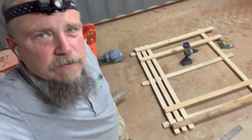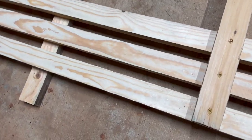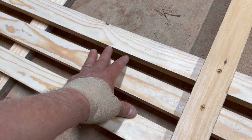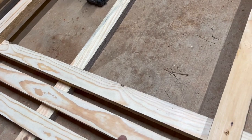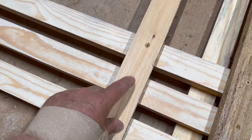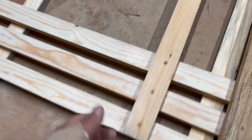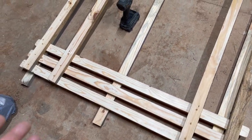Working in the evening, I'm making a wood floor for the shower. I'm putting together slats — just inventing it as I go. I'm making two-inch wide slats with an inch space in between; I walked on it barefoot and it feels comfortable. I spaced out a couple of beams on each side so the middle will be a little springy. I'm sanding the edges smooth, but I'm building it upside down so I can put the screws in from the back. Since they're epoxy-coated screws, they should last a long time. The wood itself — I really don't know how long it'll last.